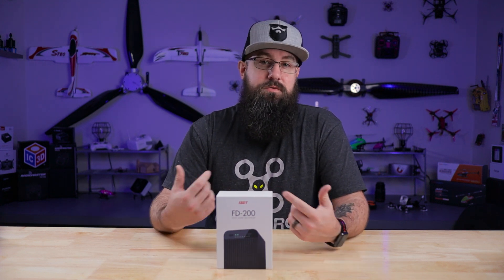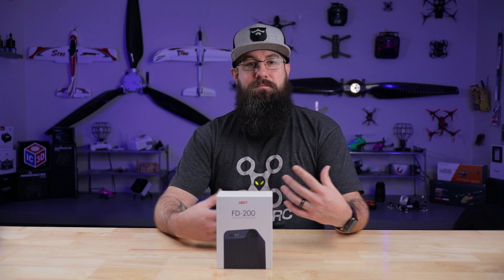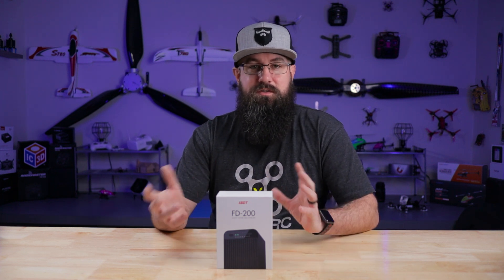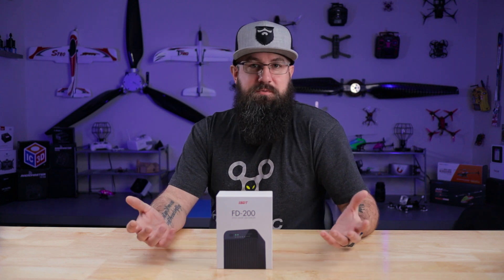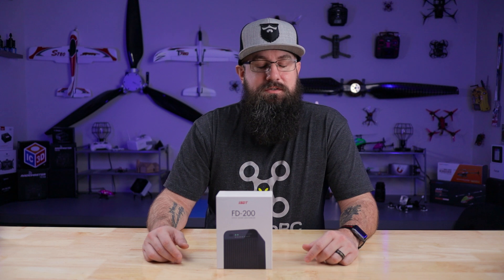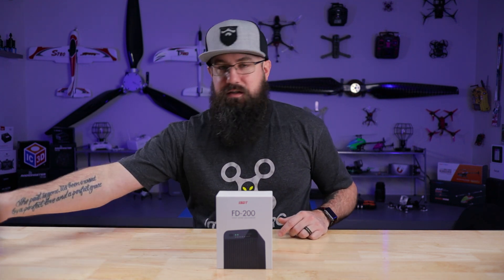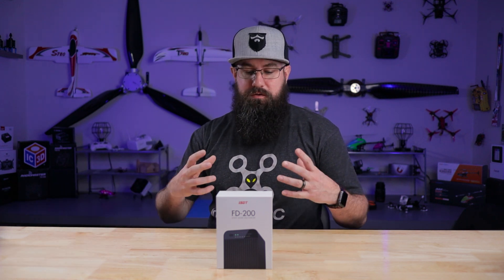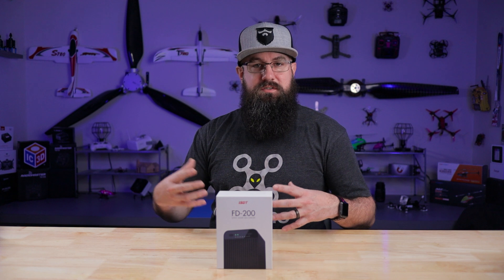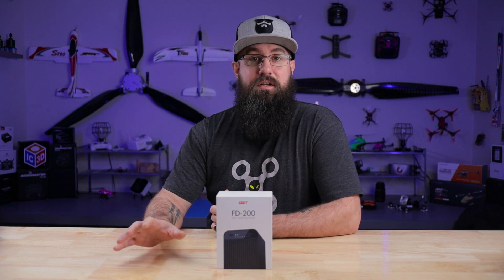It really is a good thing to have. Most chargers nowadays, when you do a storage charge or discharge, you're going to get 30, 40 watts. Some of them are obviously different depending on what you buy - you get what you pay for. So cheaper chargers probably not going to get that much. If you get a 30 watt charger that maxes out at 1.5 amps, you're not going to discharge or storage charge in any kind of speedy fashion. Even little 1500 6s packs take quite a while. So if you're one of those guys with 4,000, 5,000 or bigger multi-cell packs, it's going to take all day, especially if you have four or five of them to discharge with an actual charger.